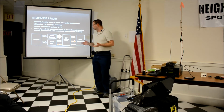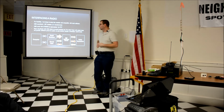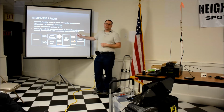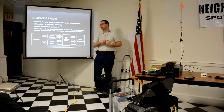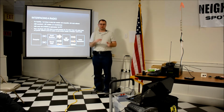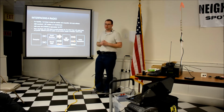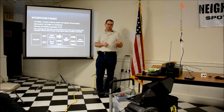Here's a rough block diagram of what I'm doing with the digipeater. I don't have a carrier-operated squelch on this. It's just open all the time, and the software that I happen to use listens and filters out the background static from the actual signal, so I don't worry about squelch on that one. I used this same sort of diagram for the first Echolink node.